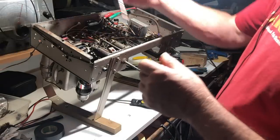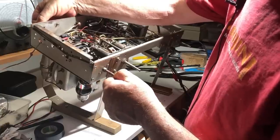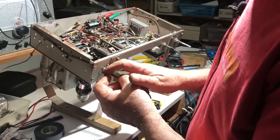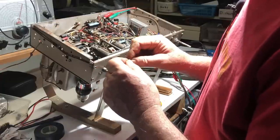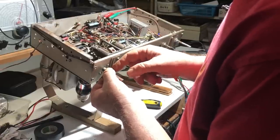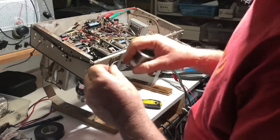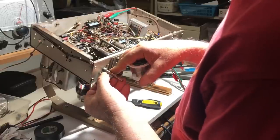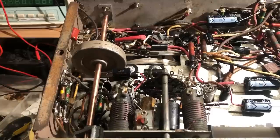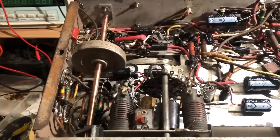Just doing a trial fit for the tuning shaft. I did try to increase the width of that groove but I have my doubts whether I'll be able to get a clip onto it. Could I get a turn of wire around it? Yes, I can do that and that might just do the trick. That's back in and working after a bit of a struggle, but it's running nicely from one end of its travel to the other. Got a nice bit of flywheel effect happening there.